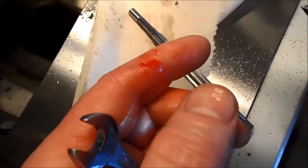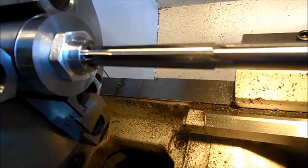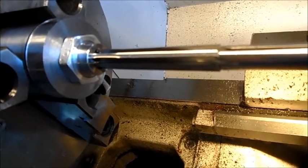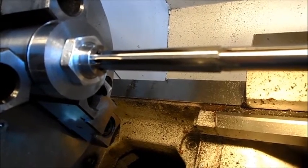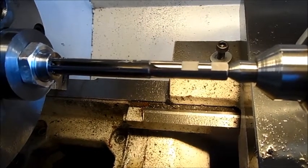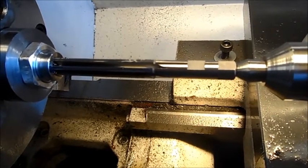I'm up to the neck - looking like this, it will come out good. I told you that this seating die I'm making will be able to crimp the bullet in place. That is not true because that point up in the neck and the shoulder will hit at the same time, so you will press your shoulder back if you try to do that. So forget about that - you can't crimp bullets. But that doesn't matter. I'm going to change to a floating reamer holder.